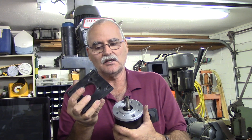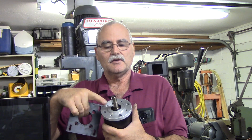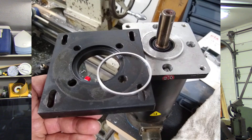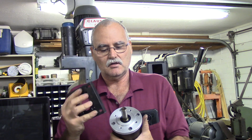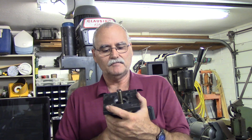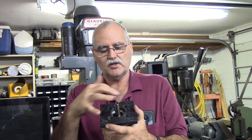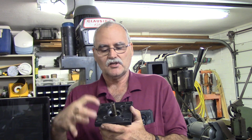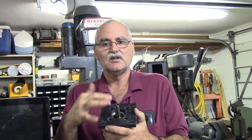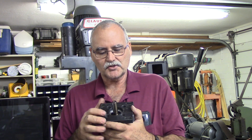I used this plate as a template and machined a bushing, because the OD of this counterbore was a little bit larger than the spigot on the servo. So I measured both and made this little bushing — now it fits really nicely. Then I used the plate as a template: the slots actually matched the NEMA 42 square flange, so I bolted it to the flange so it didn't move, then center-punched the spots where I had to drill and tap for 5/16 bolts.